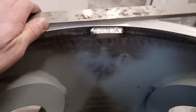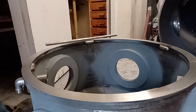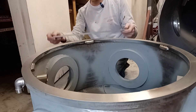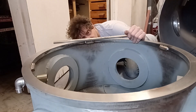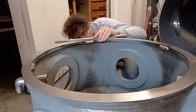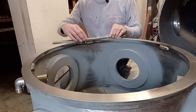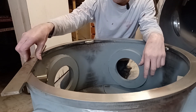I've finished all the welding on these little tabs and I've just been around and checked it with this ground bar - this is as sophisticated as I can get - literally just looking through there to see if there's any light coming through. I've checked all of them and it's absolutely as flat as I can measure anyway, so I'm really happy that I've managed to get those welded on without it distorting.